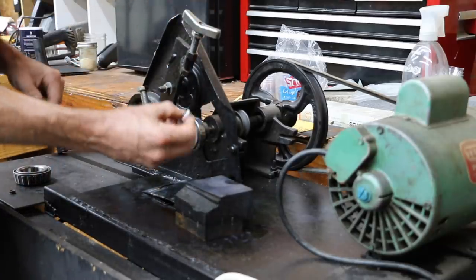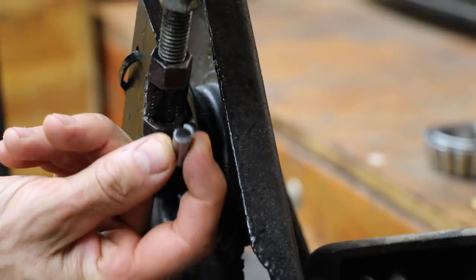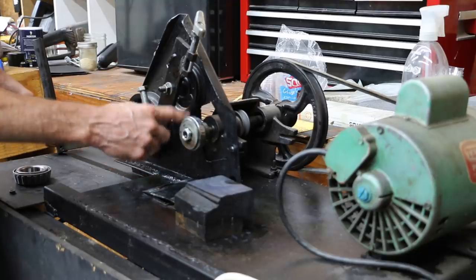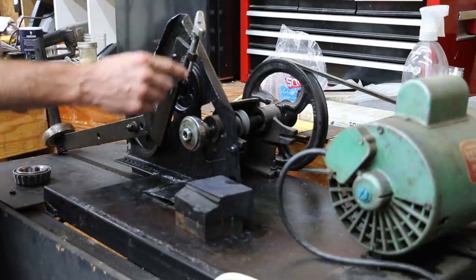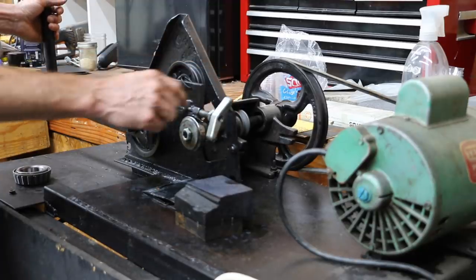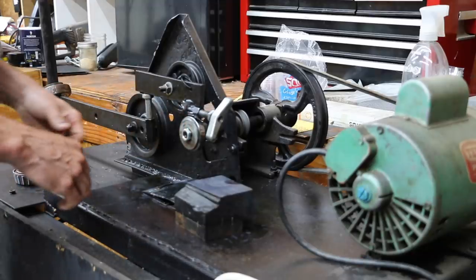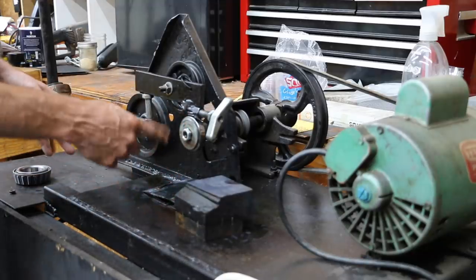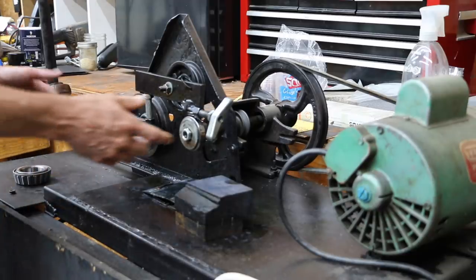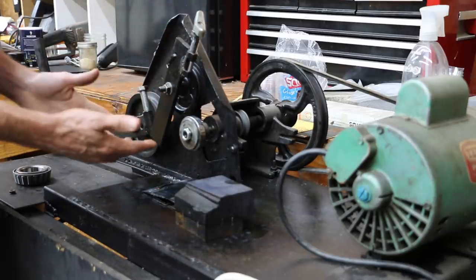The second thing I do is always use the same exact name brand bearing from a bearing set. I then insert the bearing in the bearing holder and apply the product to both the wheel race and the bearing. I then apply the weight of the bearing on top of the wheel race — at this point I don't touch any part of the device. I allow the wheel race to spin for 30 seconds, always timed. After 30 seconds, I shut off the device, remove the bearing, and assess the damage.